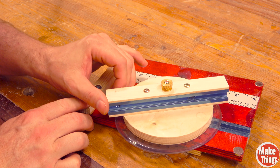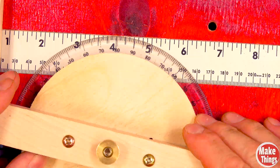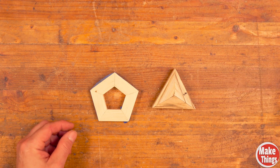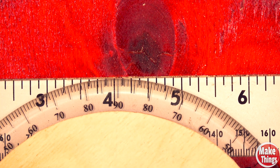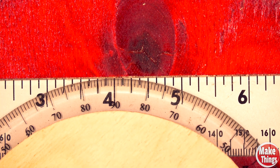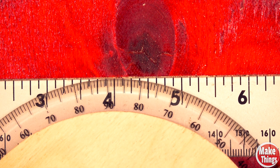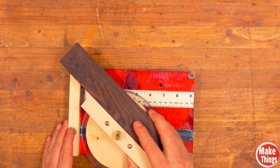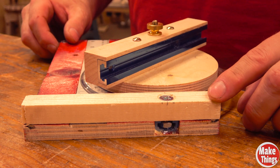The third jig I'm going to show you is a protractor arm, something I've wanted for a very long time. With this jig, I can create angles for any kind of segment I'm looking for. It works by lining a protractor to the ruler lines that are perpendicular to the front of my sled. This gives me a wide range on the top as I can set it to any line and use either the front or back side of my protractor arm. Like the circle cutting jig with the turntable, it has a safety bar.